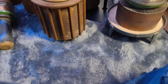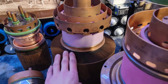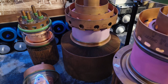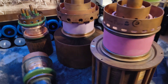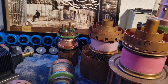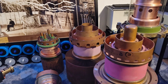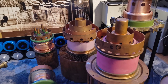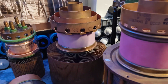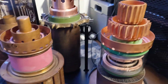Now we come to the interesting tubes — these ones are way, way bigger. This is the GU 76B, a nice big tetrode. As you can see it's very heavy — it weighs 20 kilograms. The filament takes 11 volts and 150 to 190 amps. It has an output power of roughly 40 kilowatts — a nice tube.